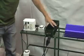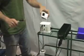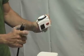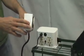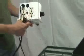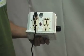Okay, when we set our lighting system up, it's best to set it up with a timer. Like I said, if you have only one light, the timer I like to use is the dual outlet. It's gonna control both of these outlets on the same time schedule. So you can plug your ballast in on one side and your fan, which should be cooling the light, in the other side. Now if you're running more than one light, I would recommend going with a 4-outlet timer, an 8-outlet timer. I believe they come in 16 and 24, depending on how many lights you're running.